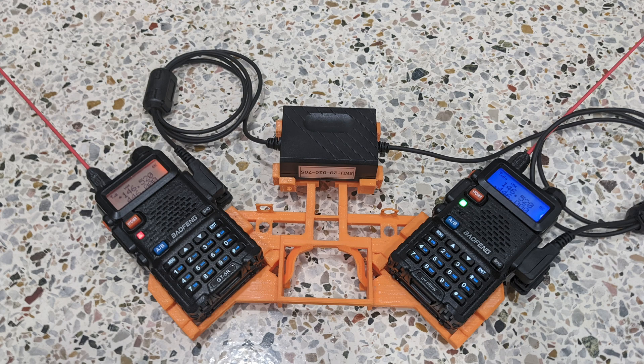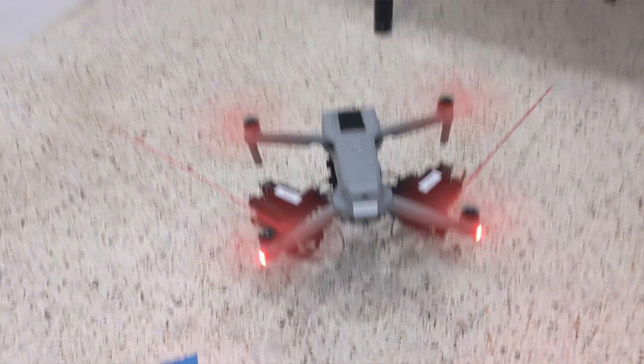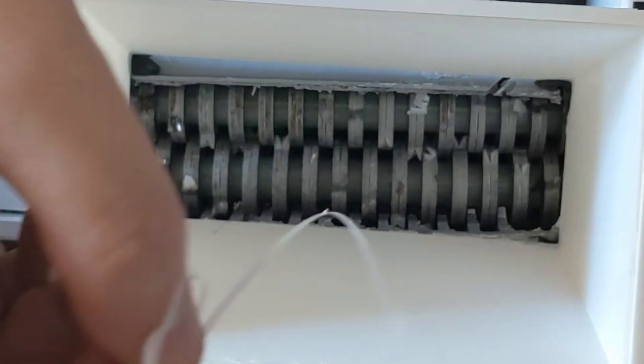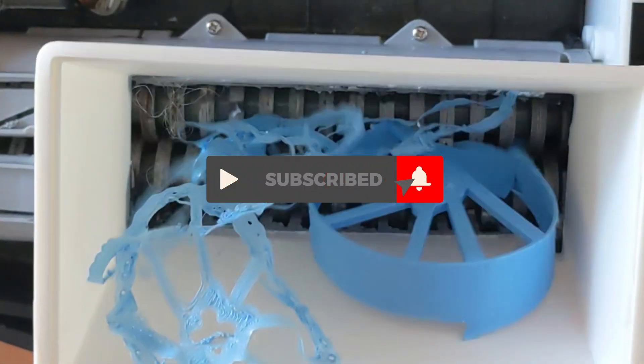Going all the way to a design where I had to realize that if the radios were too close to each other, they would interfere with each other, so I had to come up with something with more separation. But eventually came back to the same regular shape as before, just more reinforced, trying to clamp it onto the bottom of the drone. At the end I tried two prototypes which would put the radios off at 45-degree angles, with some nice signal stick antennas on the side just to get the emission components as far from each other as possible. All of this will be recycled — there's going to be a video on inexpensive filament recycling at home.